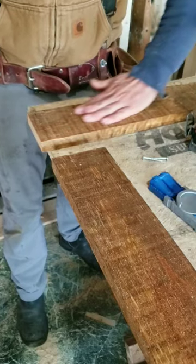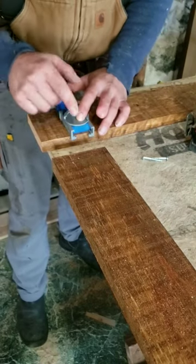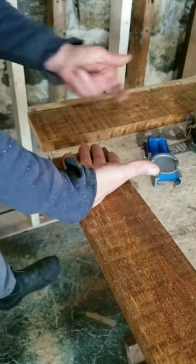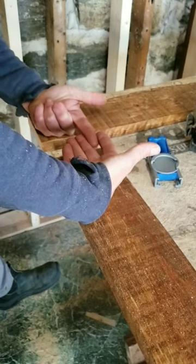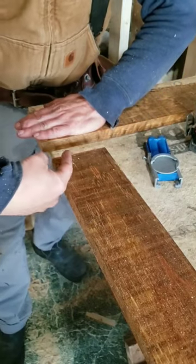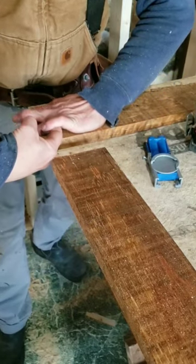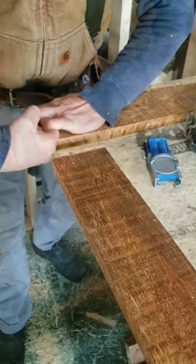The wood grain is going this direction and wood grain is going this direction. If you were to put your jig on here and drill your hole, what's going to happen is your screw is going to come in. It's going to go between the wood grain and not have as much pulling strength. The wood grain is going this way and your screw comes in — it has much more surface area to pull against the grain of the wood.